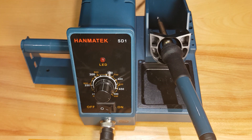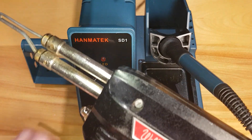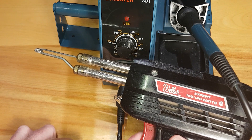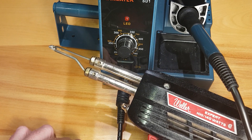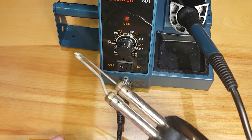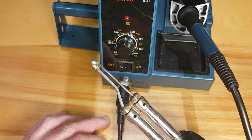One quick point: if you're soldering wires in a car or have bigger wires, you shouldn't be using something like this. You need something with a lot more power — like this 100-to-140-watt iron I picked up at a garage sale for eight bucks. It has a position switch and the tip gets nice and hot, great for soldering wires even on windy days outdoors.